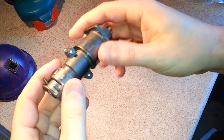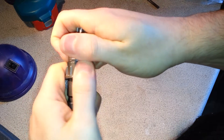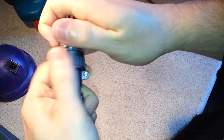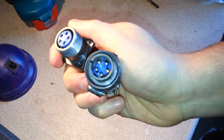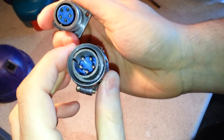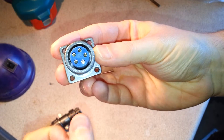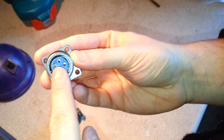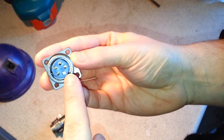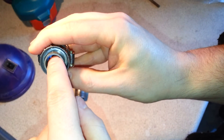In another video I covered converting one of these military style or aviation style connectors from male to female. As you can see, we can get this apart — this is now female, this end's male. Now, you might wonder why I'm making such a big deal of this, and the reason is because this part in a CNC machine would typically go on the case, on the control box. The trouble is, if you've got the pins in here — say this is for a stepper, or worse for the VFD controlling the spindle — then you've effectively got live pins available for touching at any point.